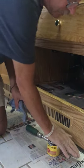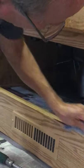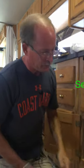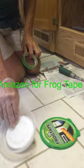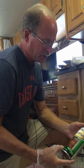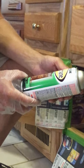Replace the lid so you don't spill any, then rub it again to get it blended in — you can see where some of the wood absorbed it better than others. The next step is to use masking tape to mask off where we don't want our clear coat, which I'm going to spray on, so we don't get overspray onto areas we don't want. I use frog tape because it does a good job keeping a straight edge. Then cover the dried stain and wood with a polyurethane semi-gloss finish.